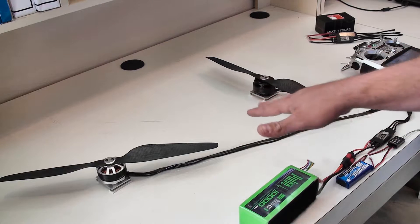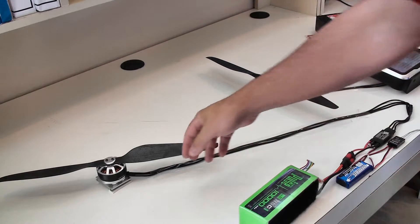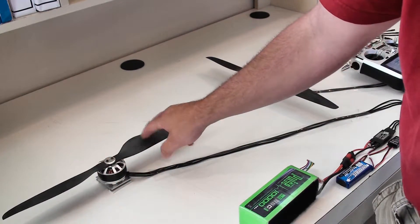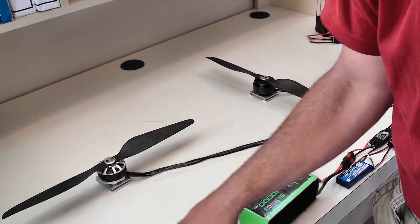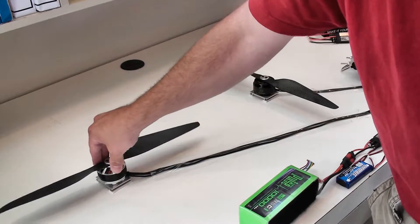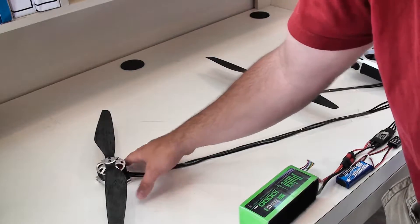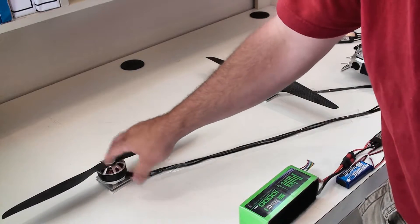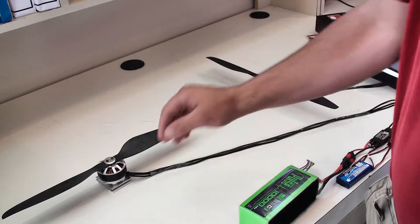What I've set up here is a very basic bench tester. It incorporates an 18 inch carbon fiber propeller mounted upside down such that we're drawing dirty air in and blowing it upwards, pushing down on this motor. It's a very high thrust test — the motor is struggling to draw air because we're so close, producing a lot of thrust and load on the motor, which is a good test.